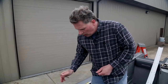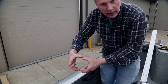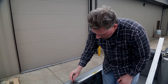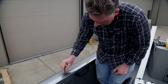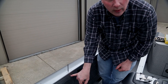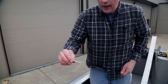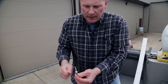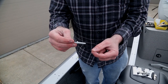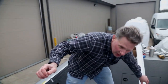Now we're going to talk about this box-design wall they have on here — it's an enclosed wall. When they extrude this piece of material, it's a fully rectangular shaped wall inside, hollow inside the top of this wall. I'm using the backside of a drill bit to show you: I drilled through the top side, but it bottoms out — we're hitting the aluminum about three quarters of an inch inside. So we don't have access to get our washers and nuts in there. We've got an aluminum aircraft rivet system we've been using for about 12 years, and we use these on all our Crestliners, dropping the rivet right inside the top of the countersunk hole on our track.